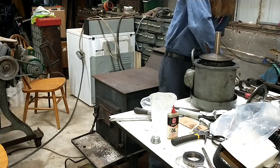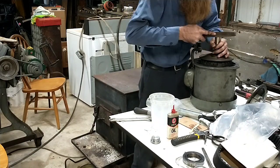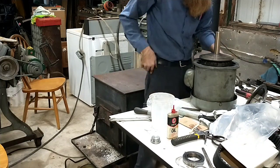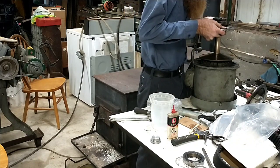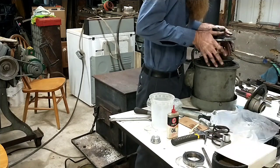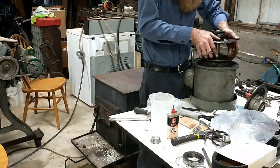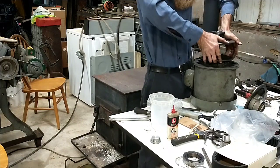Oh, something else you've got to watch on these. A lot of times there will be a bit of a burr around this snap ring groove and in the keyway where it crosses that, especially on these ones, and you'll be shaving your nice brand new components as you put it together. So we generally. This, by the way, the reason it's stopping is this end cap can be ever so slightly out of alignment with. There she goes.